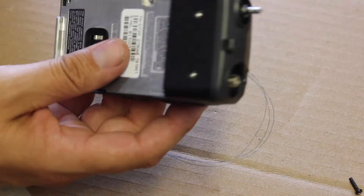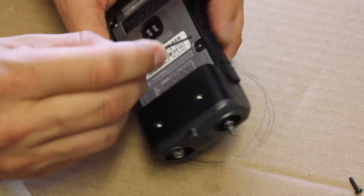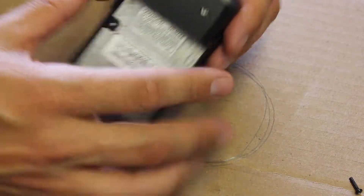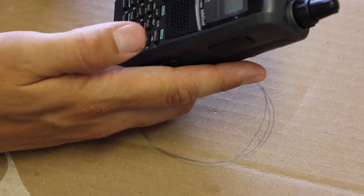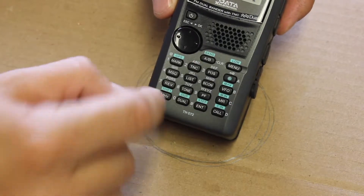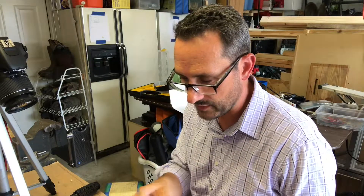Everything lines up. Take this little piece on the side — the weather protection — that's back on. Replace your screws, put the knobs back on, and you're good. If you find that your buttons don't work and you can't control anything, it's probably one of these buttons stuck down — you can only have one pressed at a time. Hope the video was helpful, especially if you have one of these Kenwood THD-72s and a bad speaker. For about 20 bucks you can replace the speaker — it's very simple. There are a few soldering points you'll have to take care of, but the main thing is you can test it out very easily.